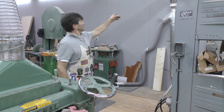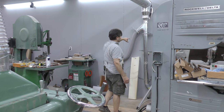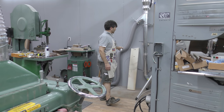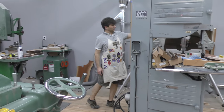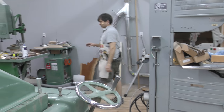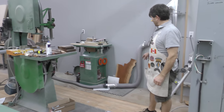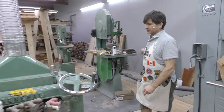So we're coming right off of there with an 8-inch. That first T drops it down and runs into a 4-inch, and that feeds the chop saw and a couple of buffers on the other side of that wall. And then there's a flexible one over here, because these machines aren't permanently situated yet, but this flexible hose just serves a dust collector, or a disc sander and a spindle sander.